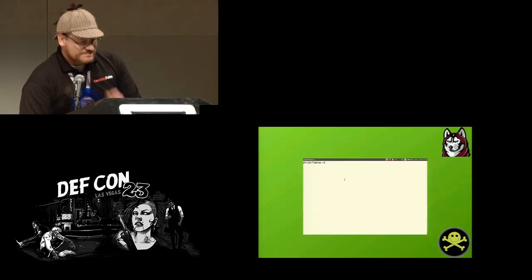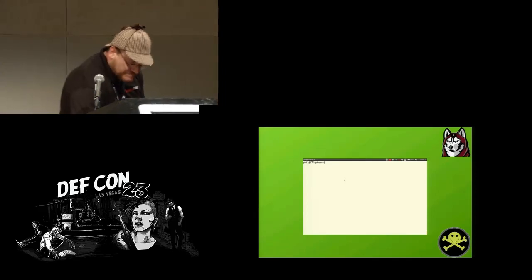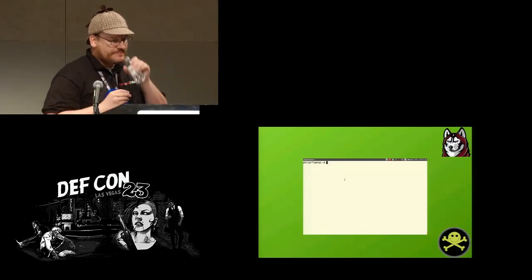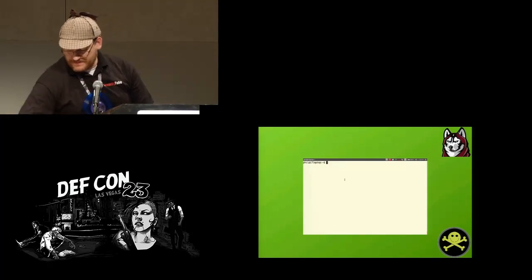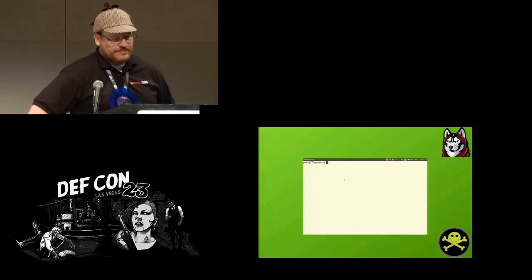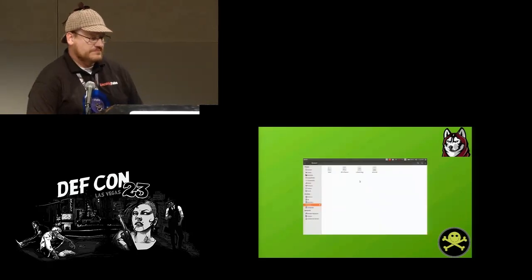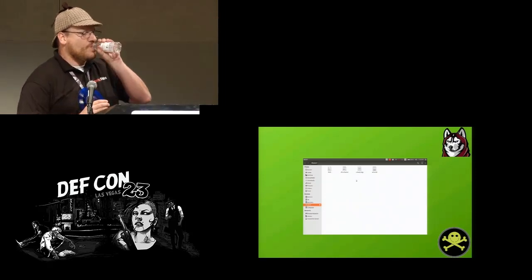In this video, I want to show you what happens when you normally plug in a BeagleBone Black. So here I have a BeagleBone Black, and I'm just going to plug it in to my Ubuntu laptop here, and it's going to load that USB multi module. So it'll take just a little bit, and what you'll see, my computer is going to display a message saying that it's connected another network device. And as you can see, it's also pulled up the boot partition from my eMMC.